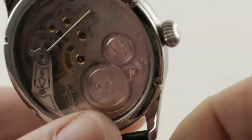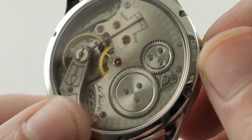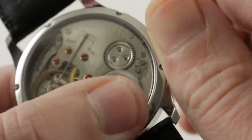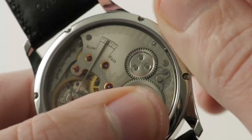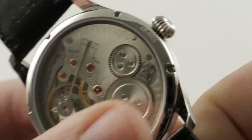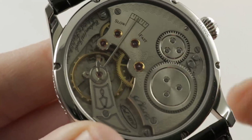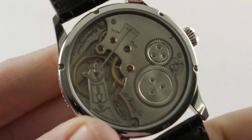You can even see some of the flourishes applied here. This is a pocket watch manual wind movement with a 46-hour power reserve. Look at that vintage style and highly elaborate click and click spring. That's not necessary, but I'm glad it's here. It's a big movement that's sized to fit its case in true manufacturer fashion. A little bit of the old school.